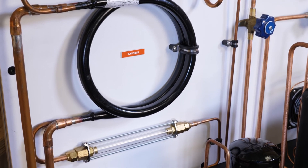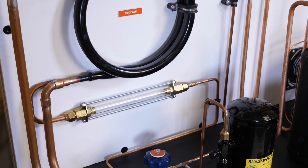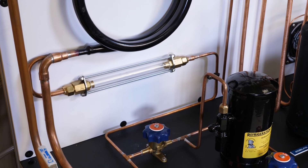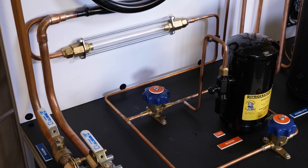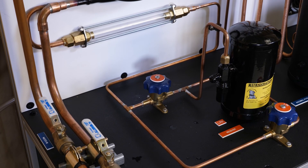And then as it leaves the water-cooled condenser, you can show the students the condition of the refrigerant is now liquid, sub-cooled. It enters into the actual liquid receiver itself. You can use the diaphragm valves to isolate that and bypass it or use it in place.